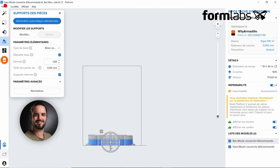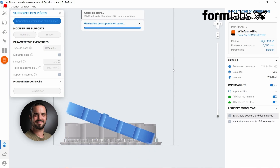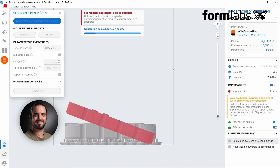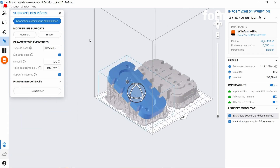The first part looks good. Depending on the orientation of the mold, we'll have laminations or micro layers. For the second part of the mold, we want to have the smoothest possible surface finish on the injected part. By orienting the mold during printing, we reduce the size of the layers. I position the mold tilting it at about 30 degrees — this inclination will really depend on the geometry of the shape you have inside the mold. Preform has already placed some supports, and these supports seem good. I save, then we move on to printing the molds.